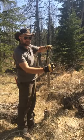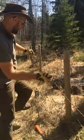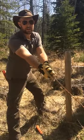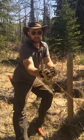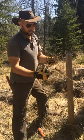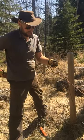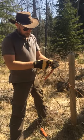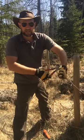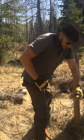So that's one side done. Then we come back to the other side and pull it hand tight. We want to pull this side as tight as we can, and then just fold your number nine wire over. You want to leave about a hand span, or a little more if you've got small hands, so that you've got enough to go around the hammer. Before you cut it, just hold here and it'll save it flicking off.